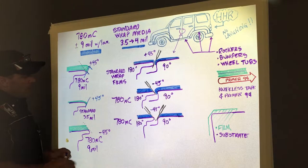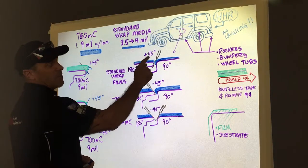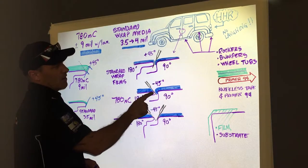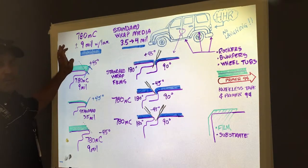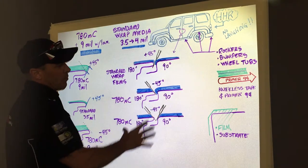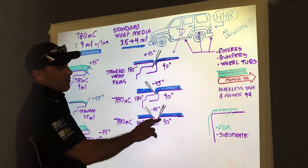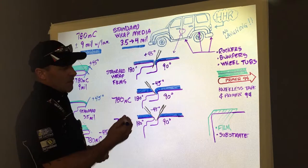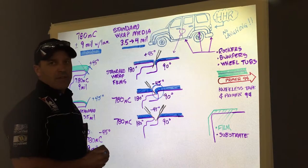My suggestion on the jams, on the 180 side, is to change your knife trajectory from a positive 45-degree — which is typical — to a negative 45-degree, because of the density and thickness of the material, creating a bevel in the opposite direction, which eliminates the possibility of anything grabbing the high side of that turn. If you really want to play it safe in the 780 world, you may want to consider doing a double negative 45, both on the 180 turn and the 90 turn, to ensure no downstream possibility of this film lifting.